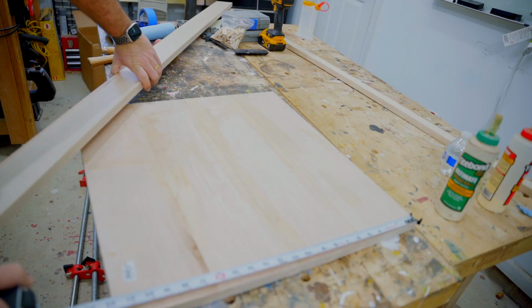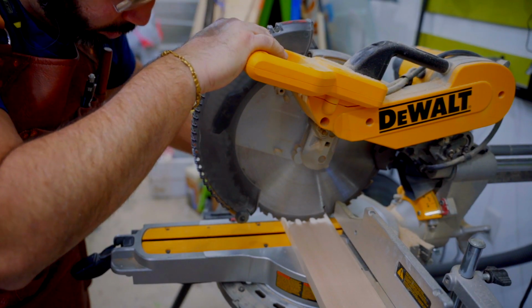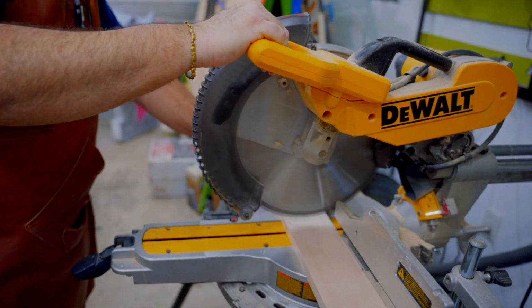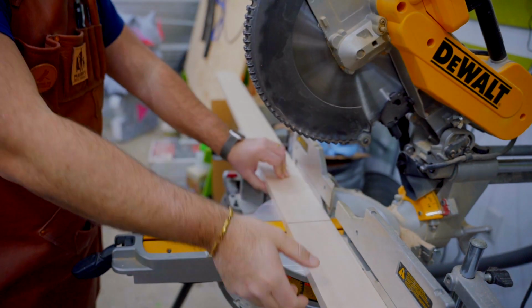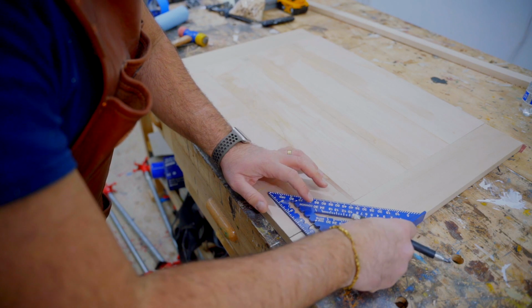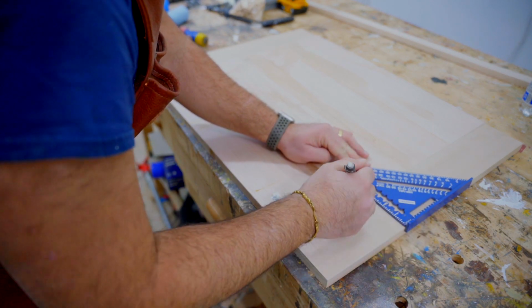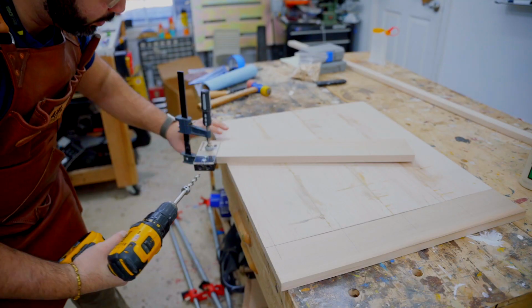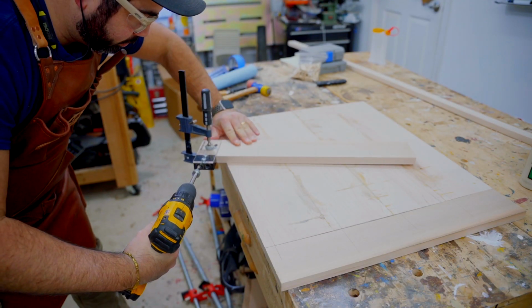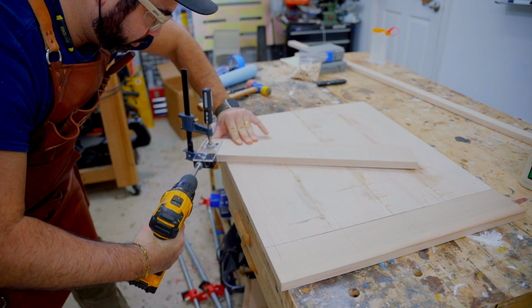Now, if I left the board with just these 4 pieces of wood glued together, it would be a pretty plain and boring design. Therefore, I decided to add a board at each edge running perpendicular to these boards, hoping this would add some contrast, and hopefully this would also help the final design look a lot more like a signature piece. Now, this is a bit of a risk. Normally you'd want your wood to be running all in the same direction with the grain as much as possible, because wood expands with humidity and it can grow wider and narrower.